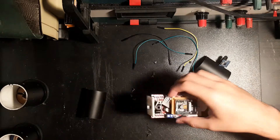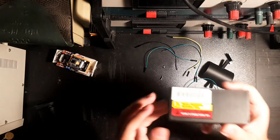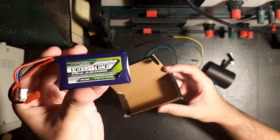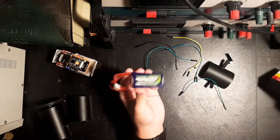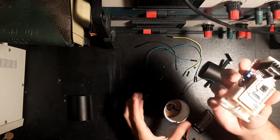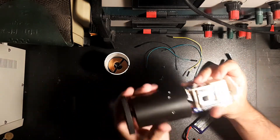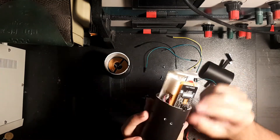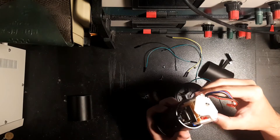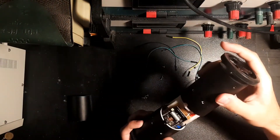When it comes to power, I use — after quite a bit of searching — this little battery. This is a 7.4V 2-cell LiPo from Turnigy, bought from HobbyKing. It is 370 mAh and you can run the drone for about 10 to 20 minutes. It fits very snugly. Once you find which side it goes, you need to match it to the camera cutout. Then you sneak the battery in here, connect the connector, hide it, and cover it back up. That's essentially how you do that.